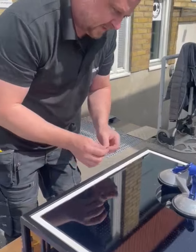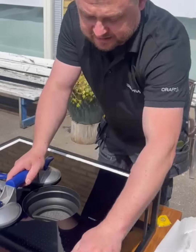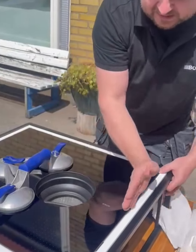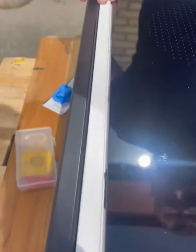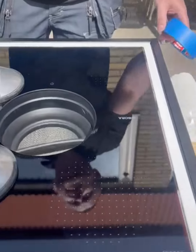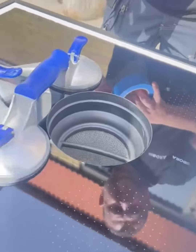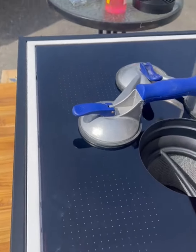All right, I'll let you finish with that and come back. So as soon as we have adjusted the height, we can check it once more. Then we adjust the distance between the worktop and the cooktop, so all around it's the same. A good distance is like 2-3 millimeters. It depends. Different kitchen brands have different standards, so to say, but usually it's like 3 millimeters.